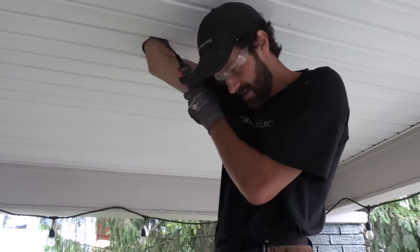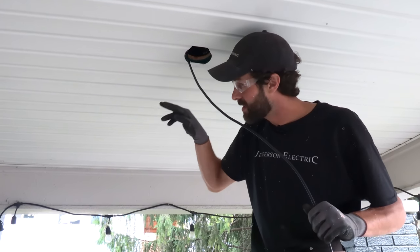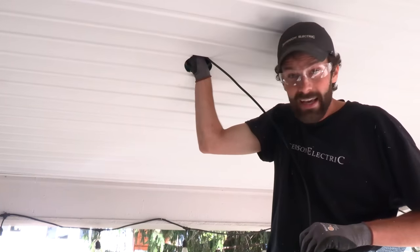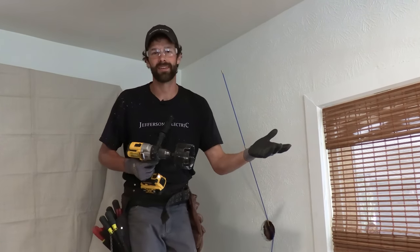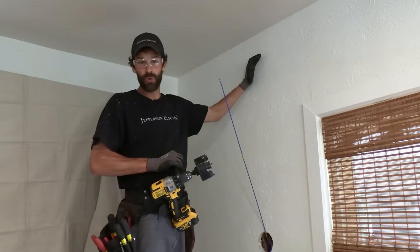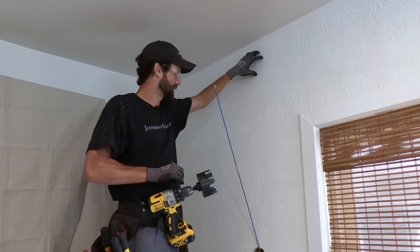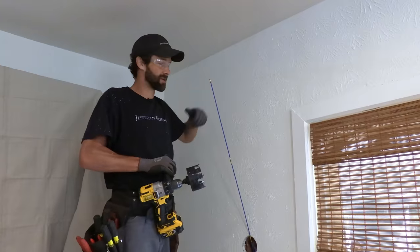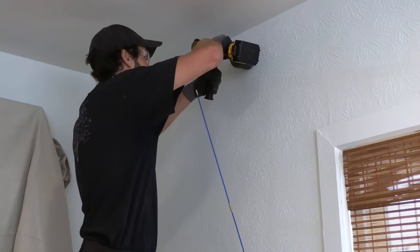I'm really not seeing anything right now. Part of that is it's a hip roof on the front porch, so the roof line comes down — we're looking at a pretty small target by the time you've got the ceiling framing and rafter framing. Let's get some brighter light. I stuck my whole DeWalt flashlight up there and now I can finally see. We determined the boroscope wasn't going to save us a hole — it was a fun exercise, we tried, and that's a good thing to communicate to your homeowner. What we know is the outdoor porch ceiling is at about this elevation. We've successfully fished up to this point, so we'll probably have to go through the wall and potentially through siding material. We're going to go straight up from that hole through the wall.